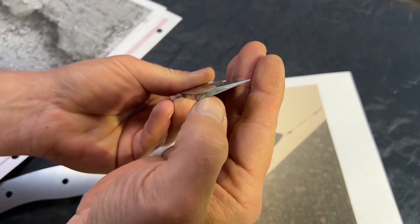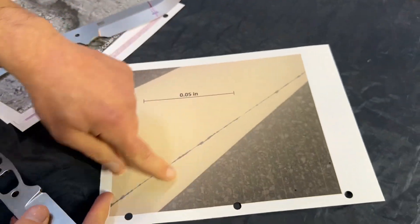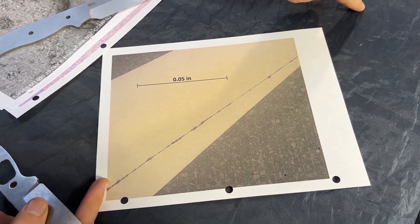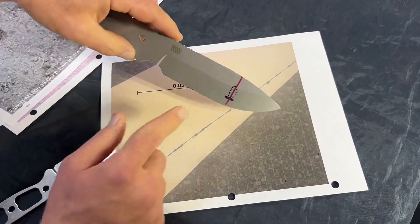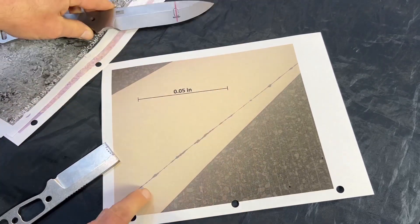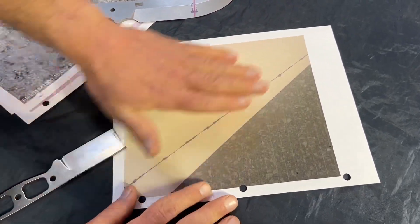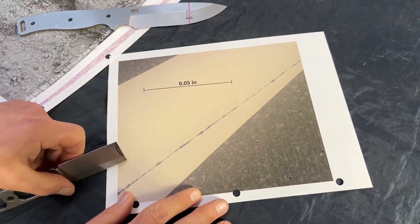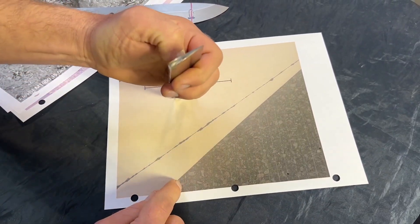What they did is cut the anomaly in half, cut the part, and then we're looking in at the part from this side. When you see a thin line coming across here, it's just what you can see from the side. After they've cut into the interior of the part, you can see the bevel leading up to the anomaly where it would have broken off out of the surface way over here — and then who knows how far it goes into the part on the other side. When you're looking at this from the top, it's kind of a regular football shape. But then as you get at it from the side, you can see that it's just one thin pocket of whatever that is. I believe it just got sandwiched out and kind of rolled in there like when you're rolling out dough baking. That's a better look at what that is from the side, just looking at it from the interior of the part.